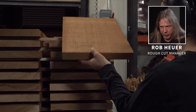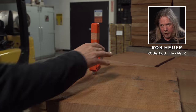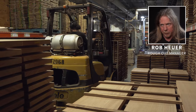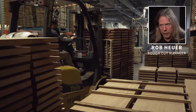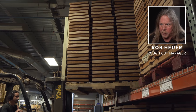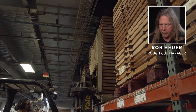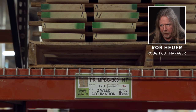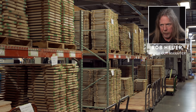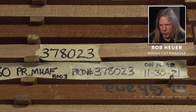He wants to ensure that it is in the 5% to 7% moisture content range. At PRS Guitars, we put a lot of care into the drying process because it affects the stability of the instrument as it goes down the manufacturing process and it has an effect on the resonance and tone of the final product. When the wood is dried, John will bring the pallet in and rack it on the shop floor where it sits to acclimate for two weeks. Acclimation time is important because it allows the wood to take in the moisture that it wants to, and the wood will not warp as it moves down the manufacturing line. Here you see the wood dated for when it goes on the floor.